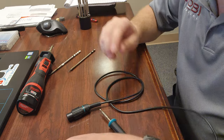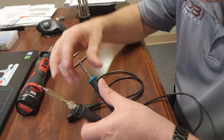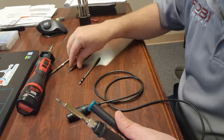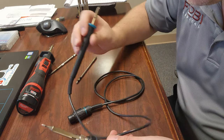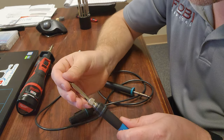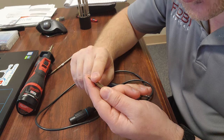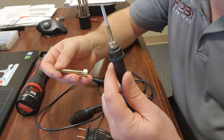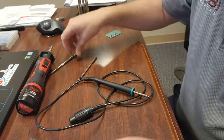If I want to change it out, just pull it out, take your next one, push it in, and you go — just like that, it's that easy. On these modern ones, you grab on to the thermal barrier, pull it out, stick your cold tip in, and as soon as it recognizes the thermistor it starts heating to your preset limit immediately. With the old style, it has to heat the tip up, and if you saturate it — like if you have a large ground plane heat-sinking away from the tip — it is much slower to react and heat the tip back up compared to this modern style.